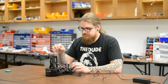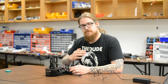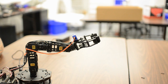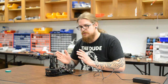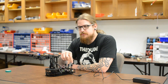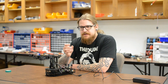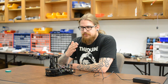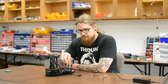There is one major difference: we have three analog inputs from these joysticks and they all auto-center, while the gripper itself is controlled via a knob. That spring-back is going to make all the difference in how you code for controlling servos. With the joysticks, we're reading the analog input and determining how far from the center we've moved, and that creates a variable telling the servos how quickly to increment their position based on how far away from center you are.